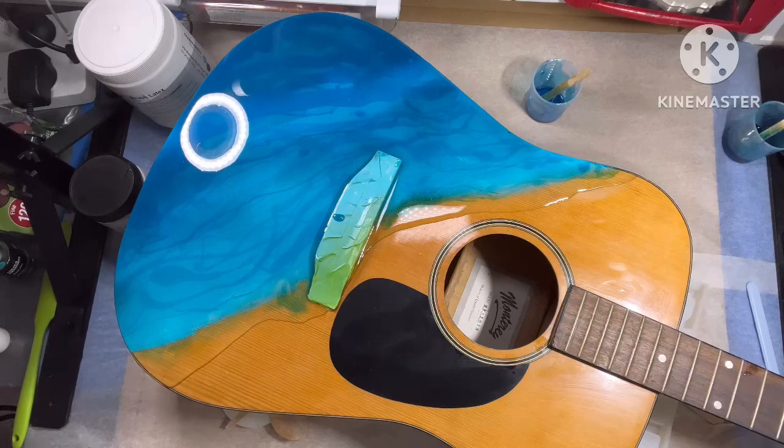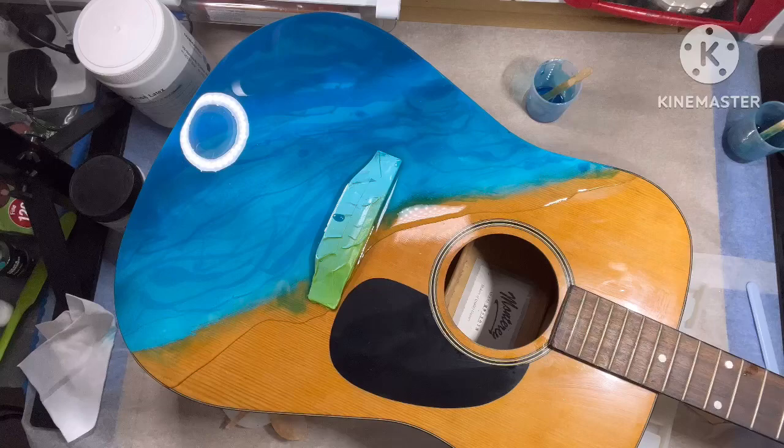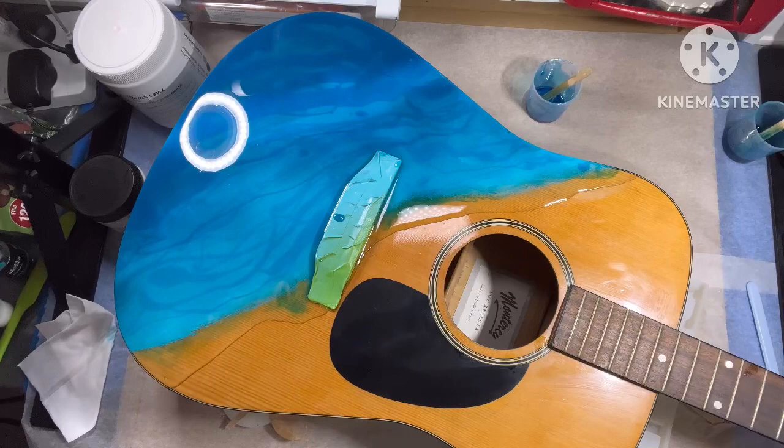Get rid of that, get a new cloth ready. Okay. Let's just add a bit of heat first. I'm gonna double glove because these are mucky and I don't want resin all over my heat gun. That's if I can get it on, because the other one's wet. That's okay, because I'll keep my heat gun dry and clean. Excuse me for blowing. So I'm just using a gentle nozzle.